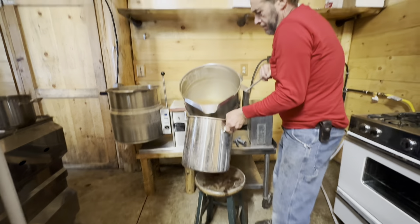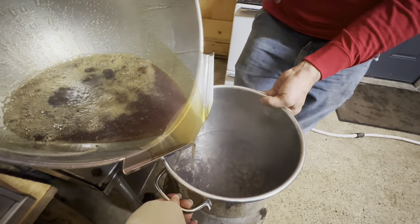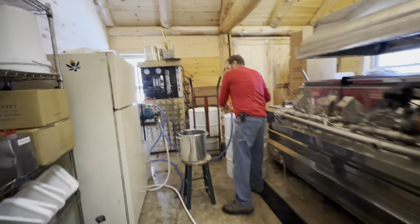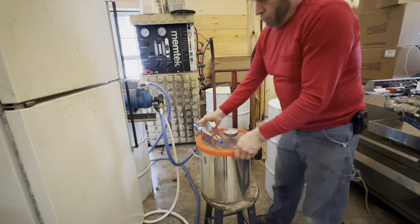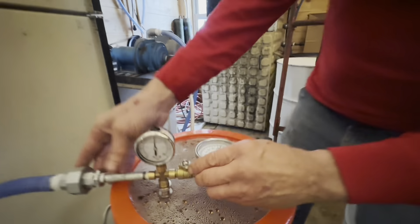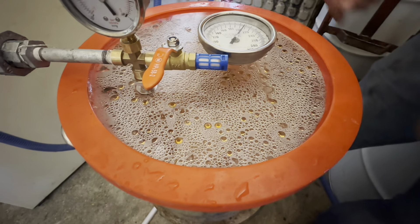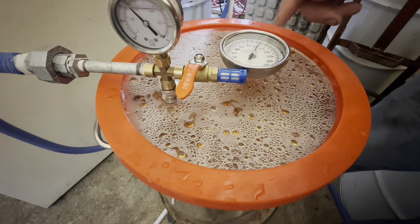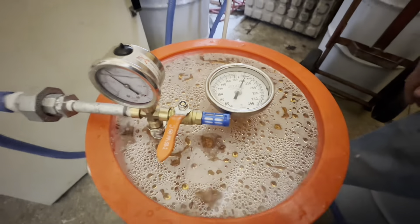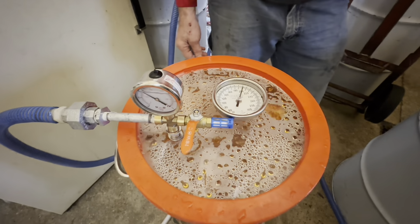Then we're going to vacuum cool it — this is a crazy one. What we're going to do is get up to 25 inches of vacuum and it's going to be boiling in here. Under vacuum, your boiling point drops. We're going to take it down to 150 degrees and it'll just take care of itself by keeping the vacuum up. You can see the vacuum gauge going up to about 20 inches, and in a moment it'll get up to 27 or 28 inches.